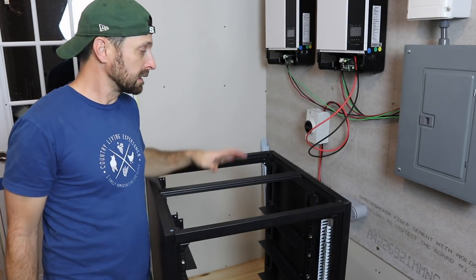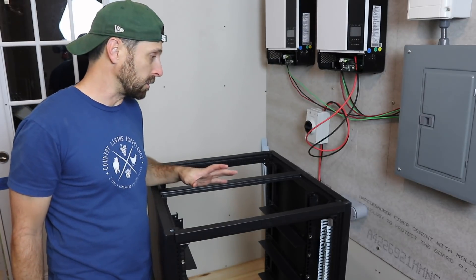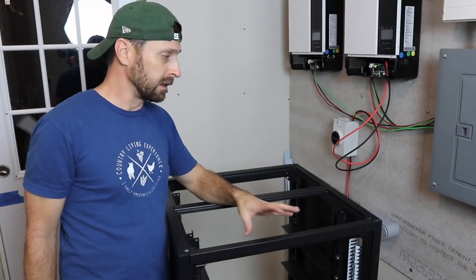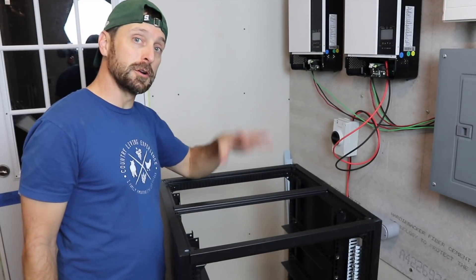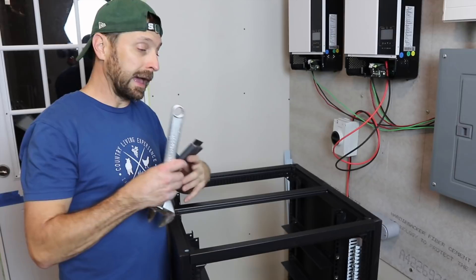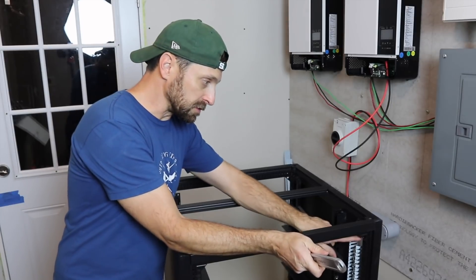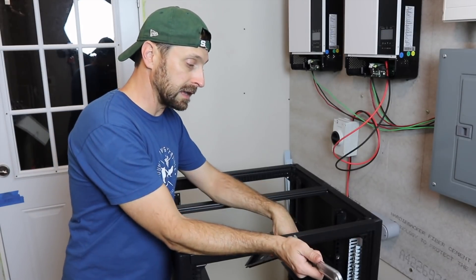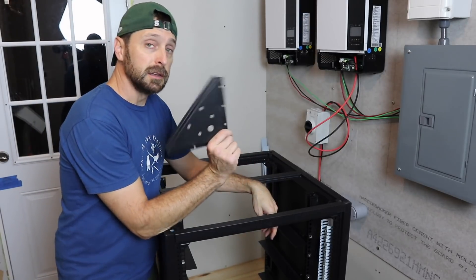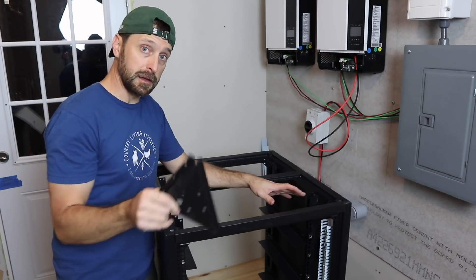Here are some tips for the assembly. I like it because it's built like a tank and I like the integrated bus bars, but it's not very precisely made — the holes don't line up very well. I moved the brackets around to each of the corners and manipulated all of them to make sure the holes would align and I couldn't do it. So I had to use a crescent wrench and actually twist two of these. I would put a screw in one place and then the screws on the other little bracket wouldn't line up, so I had to twist it and align it. Use a crescent wrench to do that. Also, don't put the corner brackets on early because you need to manipulate things so much to get them on — just save those for the end.